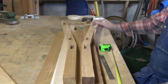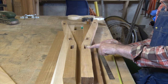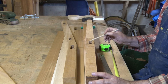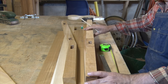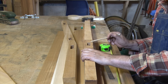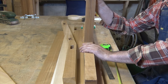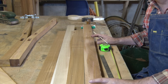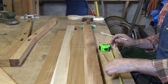Whilst you weren't watching I cut the back piece out and I've also cut mortises. This one is for the seat, this one is for the bottom of the back, this one is for the top of the back. I've also cut a little one on the front here, which is going to be for the side going between here and the front post. You'll notice that the mortise on what will become the back is much bigger than the mortise on the front — that's because I want this piece to line up with what will be the top. It'll all make sense when you see it in the end. These are the pieces I've milled out to be the back.